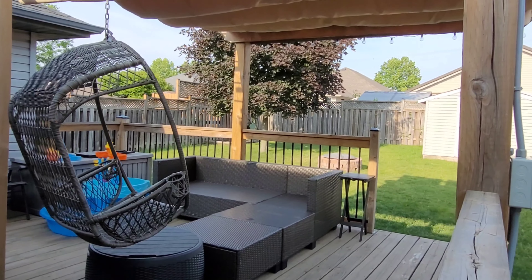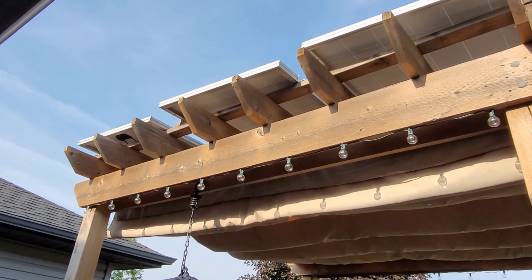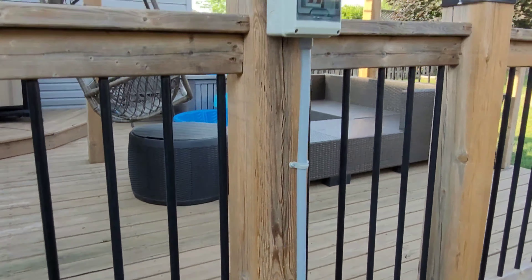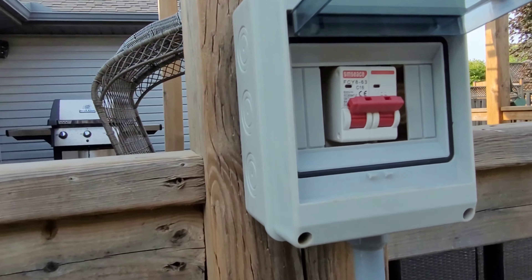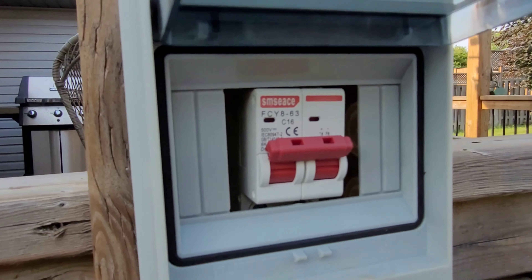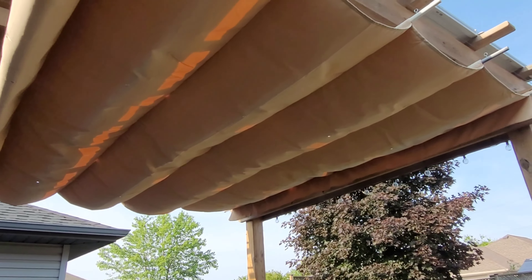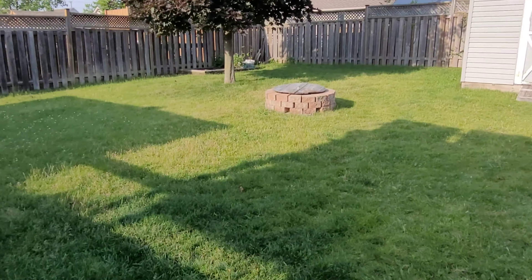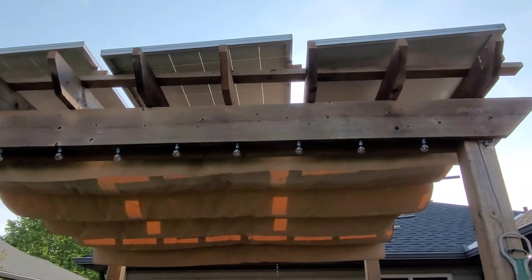Speaking of solar, the last couple videos I've had a few people complain saying I never show the solar panels. I do show them in the other videos, but here they are — they're kind of up out of sight on top of my pergola. It feeds into the unit through this little disconnect box here. This is a breaker I'm not a huge fan of — it's a cheap Amazon breaker, DC-rated 500 volts, but I don't really trust it. It's getting a little warm at times and I think if it ever had to trip under load, it might be a bit of a fire hazard.